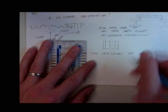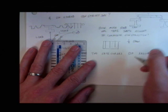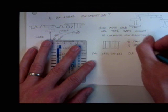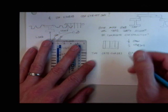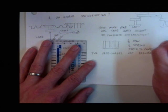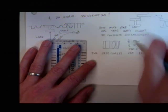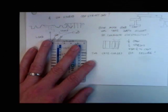One-eighth the beam span. Half the spacing, right? And then the cantilever distance, right? From center line to the tip of the cantilever. We're going to do these numbers for this side and for this side, to figure out what kind of tributary width we're going to end up with.